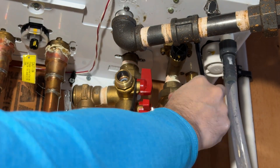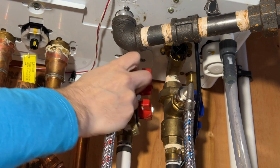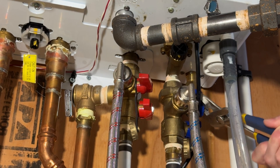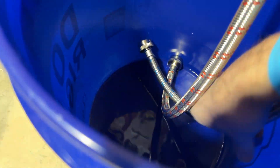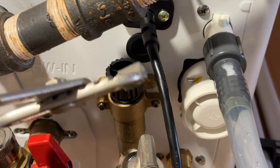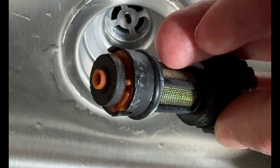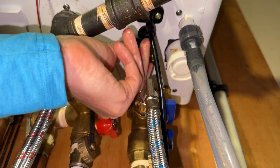Remove the service caps and screw on the washer hoses — make sure they're snug, because pressurized vinegar will be flowing through these shortly. Open the service valves and drain any water left inside the unit. Skipping this step would result in water spilling out from the filter screen port. Using my channel locks, I'm going to loosen the screen — be careful not to squeeze it too hard or it could crack. Mine doesn't look that bad. Also going to check the two O-rings and give it a quick brush to make sure it's nice and clean, then reinstall the screen.